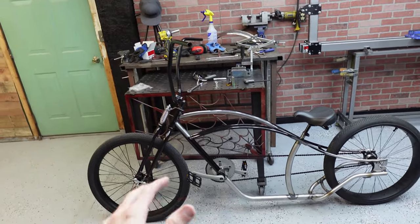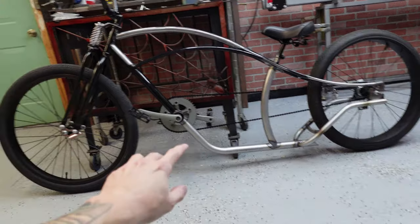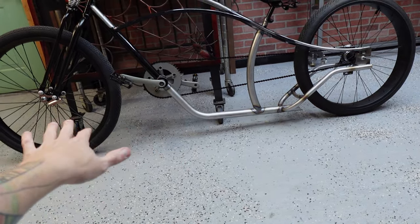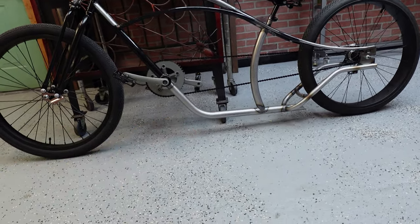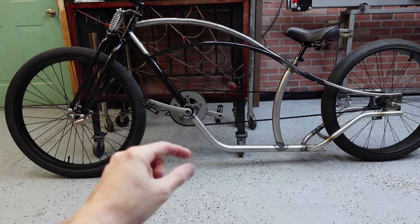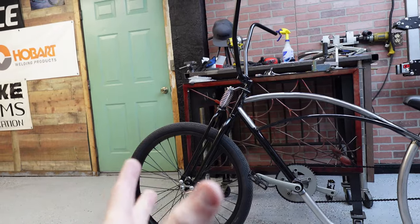And I sat on it, it's pretty comfortable. It's gonna be a nice rider. It's not super duper low to the ground. It even has a little bit of an up rake, so it'll give it some suspension travel. So if you ever did need to use the suspension, you're not gonna bottom out. It would actually level the bike out. Also, if you ever were to hit anything, it would allow it to bring you up on it instead of you hitting it dead on. So I like where it's sitting. I may try to come down a little bit more just to level it almost. I don't like it too much, but not a whole lot I can do as far as the way the springs are. We also need to make a headlight mounting bracket.